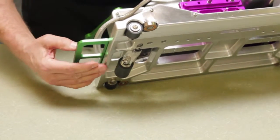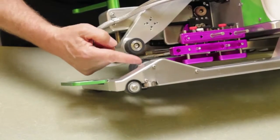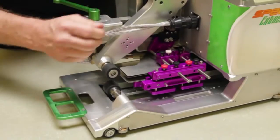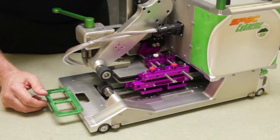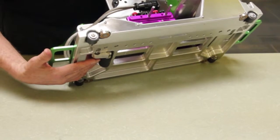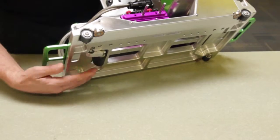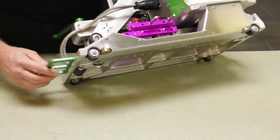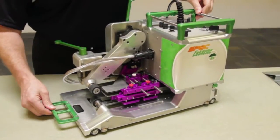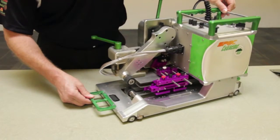But when the drive wheel is pushed out, down, and across to attach to the lower pressure roller, the machine becomes self-propelled and will move when welding. The drive roller in the down position causes automatic welding and movement of the machine, whereas in the up position it allows for either stationary welding or easy transport to and from the beginning or ending of welding.